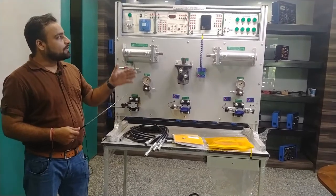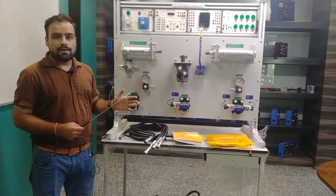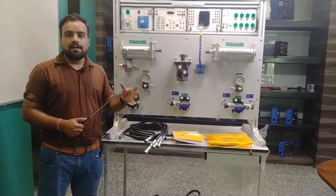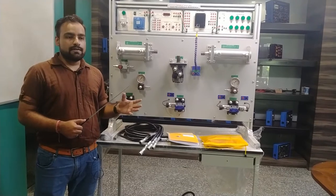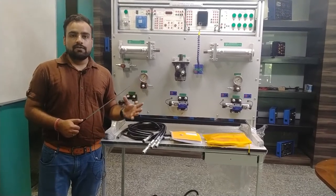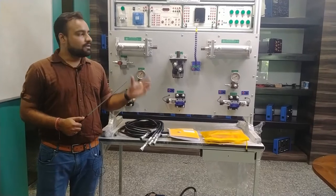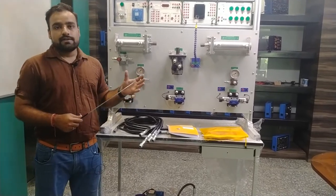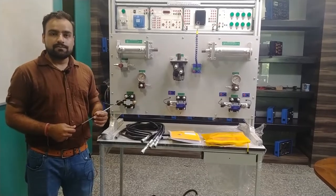This workbench is also configured with a PLC IO module, which will give you a better understanding of hydraulic systems used nowadays for industrial purposes. Hydraulic systems are used in many applications where high power demand is required. They work similarly to pneumatic systems for operating cylinders, but hydraulic uses an incompressible liquid medium, which allows it to exert very large forces. For maximum force movements and actions, hydraulic power packs are required.